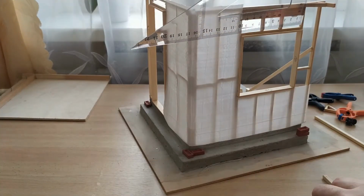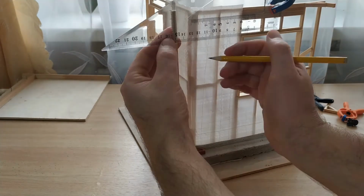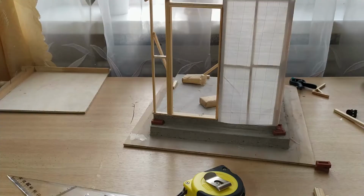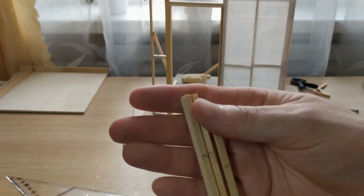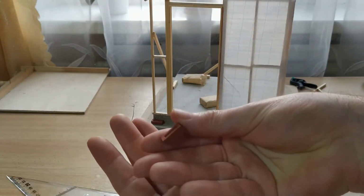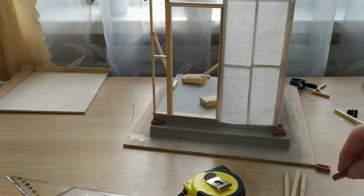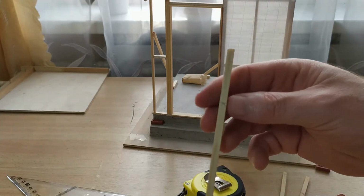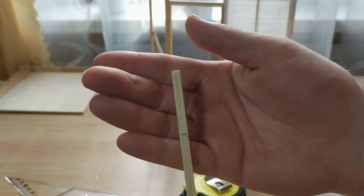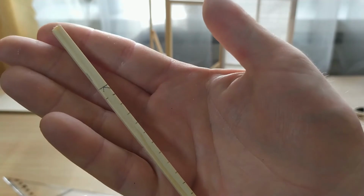And the next step is gauging the brickwork. We want the brickwork to be flush with the top of the window, so when we lay bricks above it, there won't be any awkward cuts. Hopefully that's in focus. These bricks are 5mm in height, so basically I want to have a 1mm bed. So I'm just going to measure 6mm intervals down from these datum marks, and that'll be my gauge. And that's essentially what it looks like.